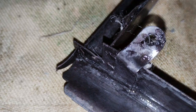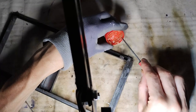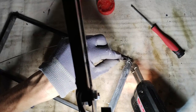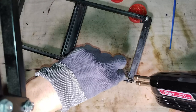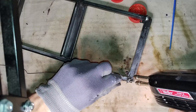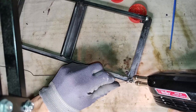There are four small and fragile flaps that are meant to cover holes with the purpose of giving the impression that the frame is made of solid metal instead of being just a thin sheet of iron. However, there is nothing where these flaps could safely rest. They might be inadvertently pressed, or they could get entangled with something, or even become dangerous hooks. To attach them to something, some solder is applied inside the frame behind them.